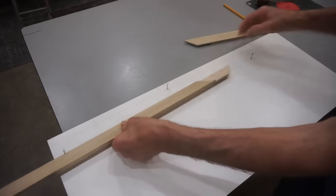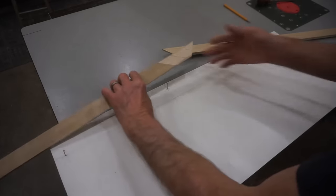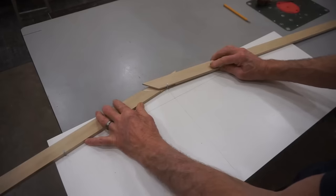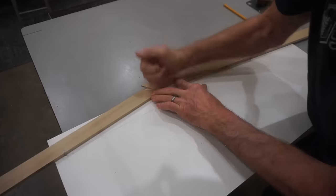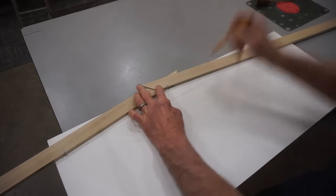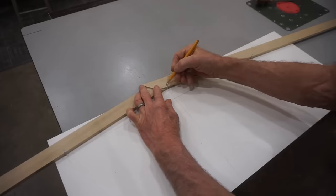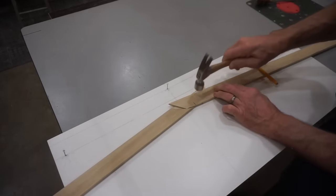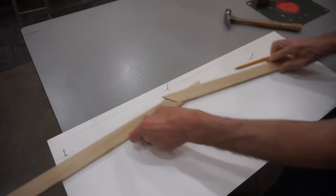Now comes the cool part, where the sticks get stuck together in a slick setup for drawing this arc. First, I lay the sticky stick next to the two nails on the left, and then place the right stick against the nail on the right side and swing it down till it hits the middle nail over the left stick. Once edges of both pieces are lined up on their respective nails, I simply tap down on the half lap joint to stick the strips together in exactly the right position for drawing an arc with a chord of 24 inches and a bulge of 1.5 inches.